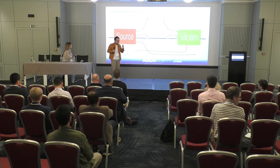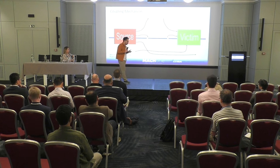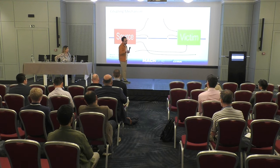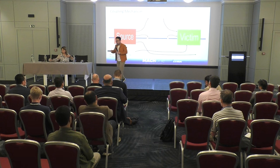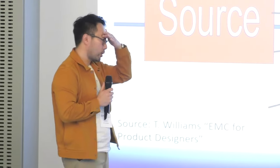Part of my job is to work with clients, and sometimes other companies, especially if they have good engineers who started working back in the 80s and 90s. They all have their rules of thumb, and some of those rules of thumb are just not true in today's design, with all this FPGA and high-speed design. It's quite hard to convince them that one ground is always better than separate grounds, and connecting them using ferrite or whatever. But it takes time. Once they see the effect, as we demonstrated in the previous slides, they will buy into the idea. Okay, so that's all the discussion on ground.